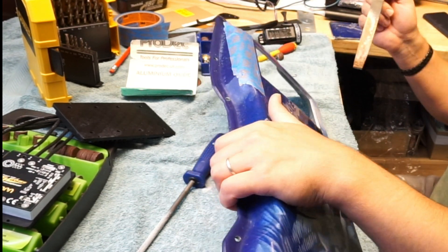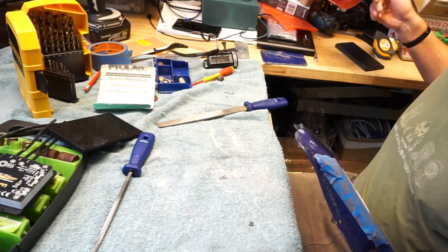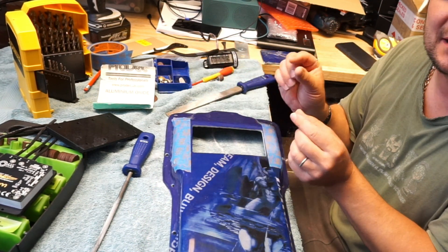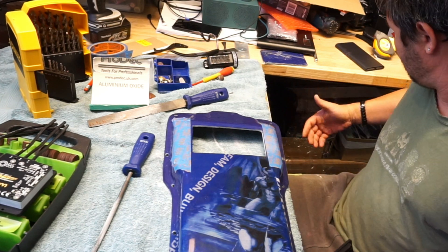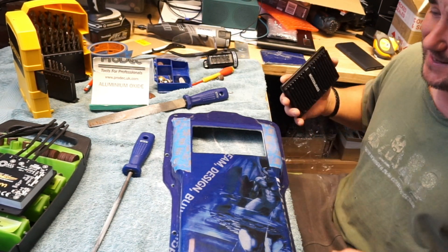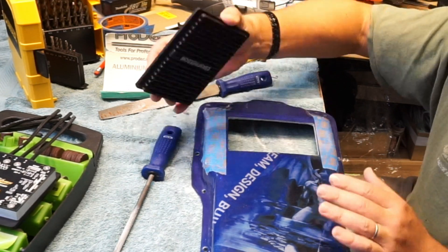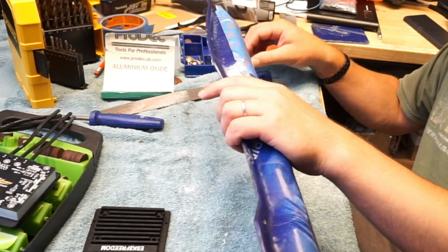One good piece of advice: when you actually cut the hole for the heat sink, go a little bit smaller. So when you do your template and mark it out, cut on the inside of the marker pen line, not the outside. It's quite easy to work with fiberglass and you'll need that extra half a millimeter to finish the cut by hand. The main cut I made using the Dremel. Glasses, gloves, and also a mask — a really good mask — because this dust is nasty. The final touches are done by hand. I'm trying to get it as tight as I can, checking it, and just removing a little bit at a time. You don't want massive gaps all the way around. Take your time and enjoy the DIY. Don't rush — that's the best part of it.